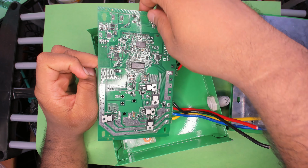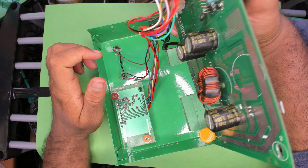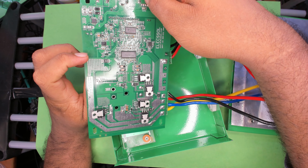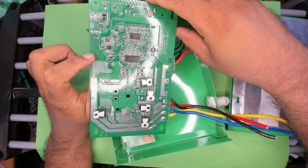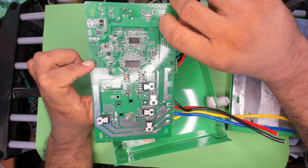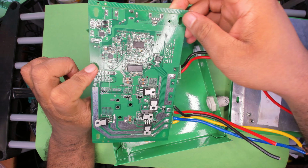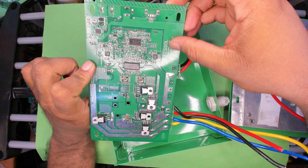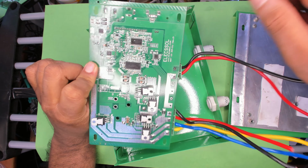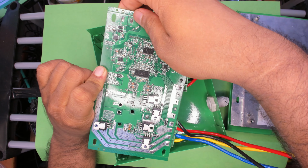I think they have a little 5-volt buck circuit on its own to drive the logic. They have a USB port here as well, which I'm not sure if that provides power or is for onboard programming, but I doubt that. But that's not populated. There's a hidden 12 volts in supply, which I'm... Yep, that seems to be on the same rail as the load. So this is for output. But they don't have a cutout in the main case to do anything useful with it.